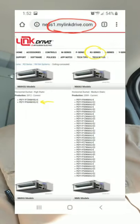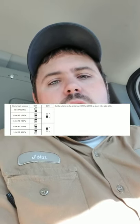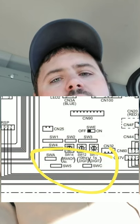The call was we've got an indoor fan coil that's being noisy. This is an eight-ton ducted unit and the model is PEFY P96NMHSU-E. Not exactly sure what was causing the noise. I took a look at it while I was there, wondering if it was airflow. If you've ever wondered how the airflow in these indoor fan coils works, there are basically two ways that's set. Number one, there's a set of dip switches inside the unit on the board that selects a static pressure range, and based off of that range you get different fan curves. So if your fan is at a certain static pressure on low, middle, or high fan speed, that selects your fan curve, and the static pressure it hits in that range will dictate the airflow.